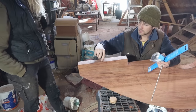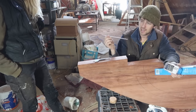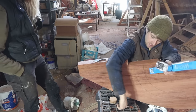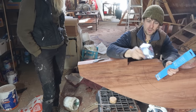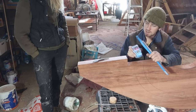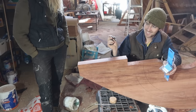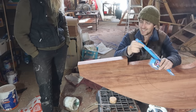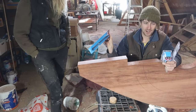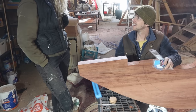So what I'm going to do with my variety of things, with a counterbore and a 6mm drill bit from either end, so that meets. Then I'm going to run a hole saw through as far as it'll go till it bottoms out. Then I'm going to plough it out with a 38mm spade bit, because that's the biggest one I could find. Then when it gets too far, I'm going to put the spade bit on the extension and keep going. Don't know if this is going to work. Wow.